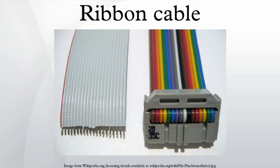When electronics hobbyists are working on their computers or digital musical keyboards to mod or hack them, they sometimes have to solder ribbon cables. Soldering ribbon cables can present a challenge to a hobbyist who has not been trained as an electronics technician. In some cases, hobbyists strip off the wire with a fine razor and then separate the wires before soldering them. Some hobbyists use fine sandpaper to wear away the plastic insulation from the wires; the sanding also primes the copper tracks, so that when the soldering iron is touched onto the bare wire, the solder is guided into the track.